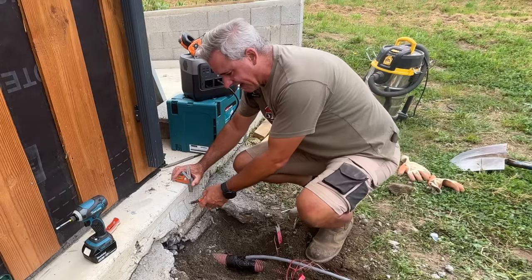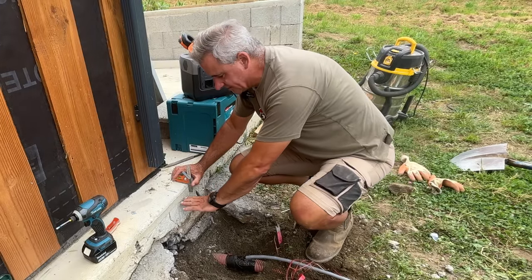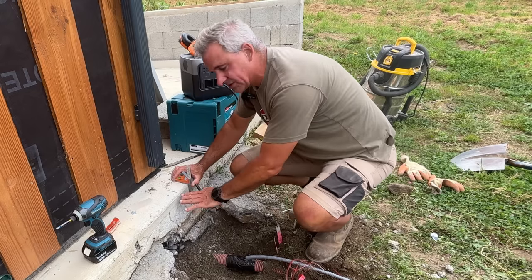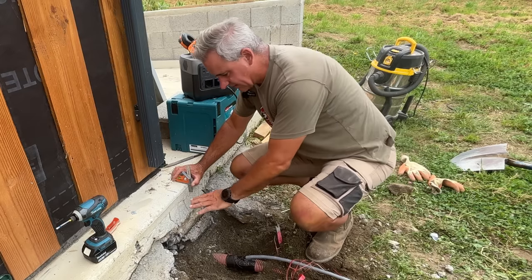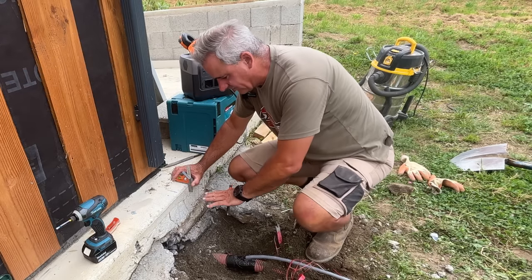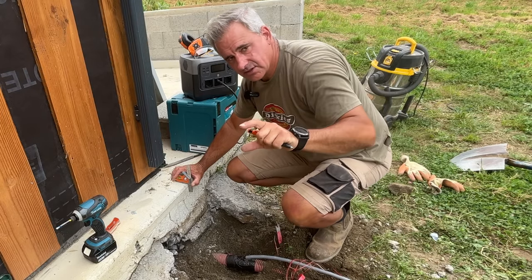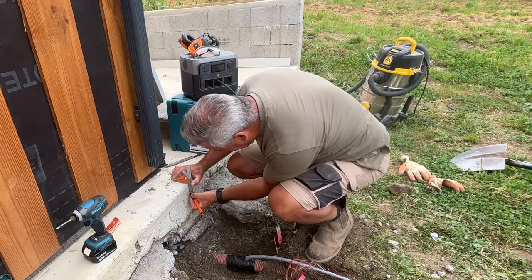So as we're doing these paths, the lid of this little manhole will be the top of the path, we're just dropping down 5 centimetres. So it's just a little lip here. It's just another protection. If there's so much water, I doubt it because it's all going to go downhill, but it's not going to go back onto this concrete. So every step we do, this will now be level with some curbstones that we're going to be putting in, and then the garden will be 5 centimetres below those curbstones. So I'm just going to mark off that there.